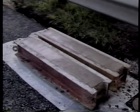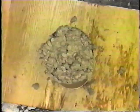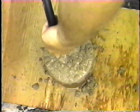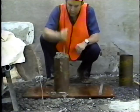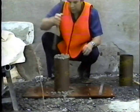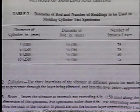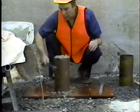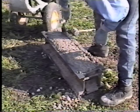For beams with depths between 6 and 8 inches, concrete is placed in two equal layers for rodding and just one layer for vibrating. Selection of the consolidation procedure depends on the slump: less than one inch, vibrate; more than three inches, rod; in between, optional. When rodding is used, the number of strokes is usually 25 for the most common molds; Table 2 of AASHTO T-23 gives requirements for other molds. After each layer is consolidated, the outsides of the mold are tapped lightly 10 to 15 times to close any holes left by the rod or vibrator. When beams are made, this tapping should be followed by spading the concrete along the sides and ends with a trowel or other suitable tool.